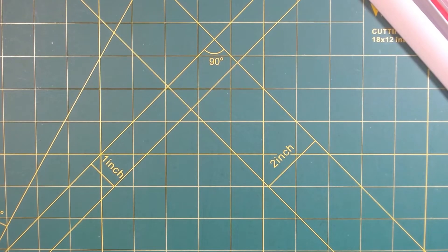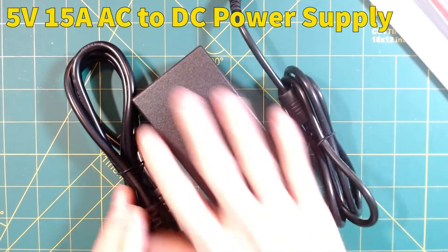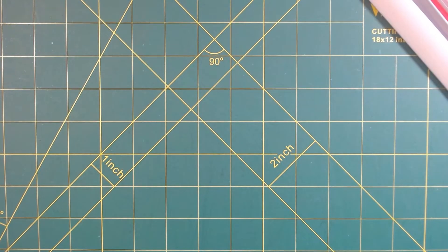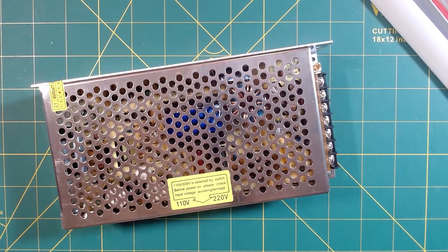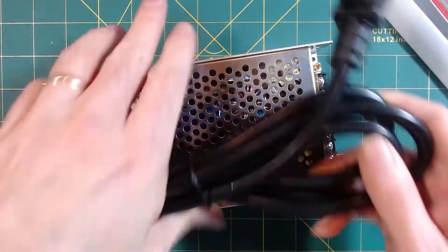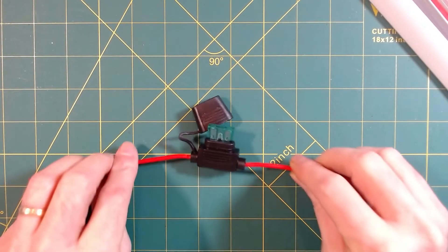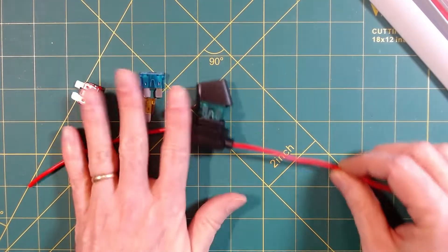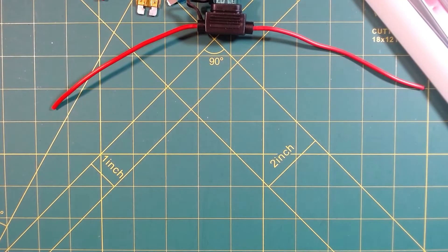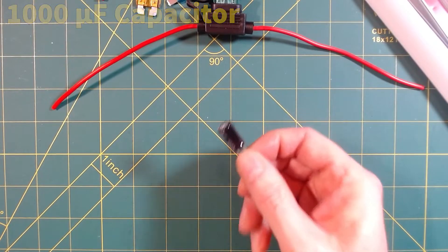You're also going to need to power your LED strips and your controller. Depending on how many LEDs you have, up to about 15 amps I like to use what I call brick-style power supplies. Anything above that, you're going to need what I call the transformer style — just remember that with transformer styles you will need to buy a separate AC power cord. Most good power supplies come with over-voltage and over-temperature protection, but if you want to be extra cautious, you can get an inline fuse holder, add a fuse to your project, and have an assortment of different fuses. I also like to add a 1000 microfarad capacitor to my power supply just to help even out the power.